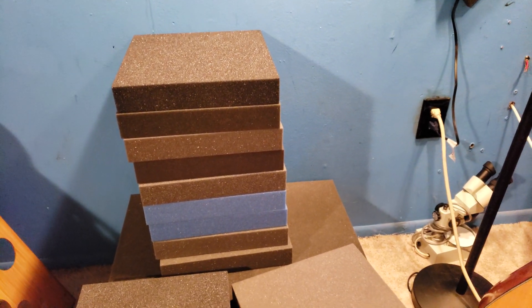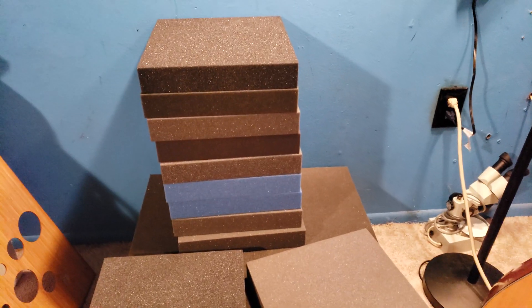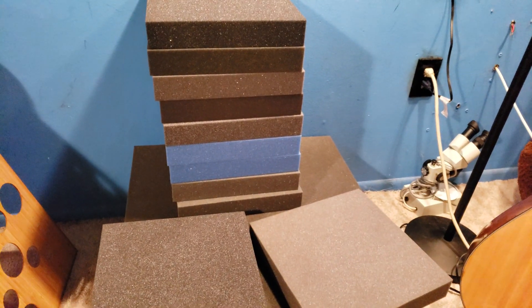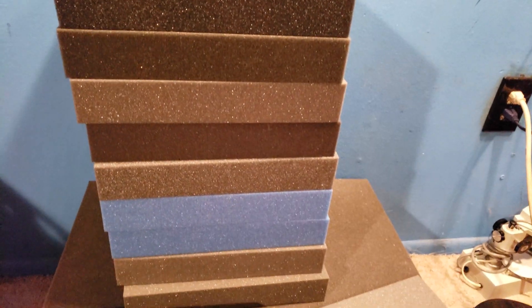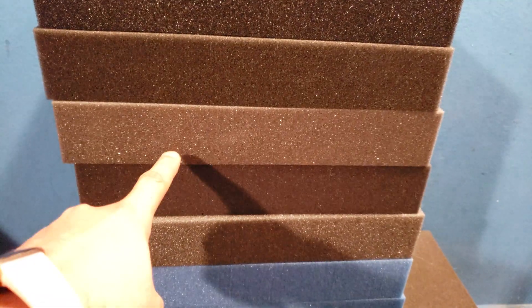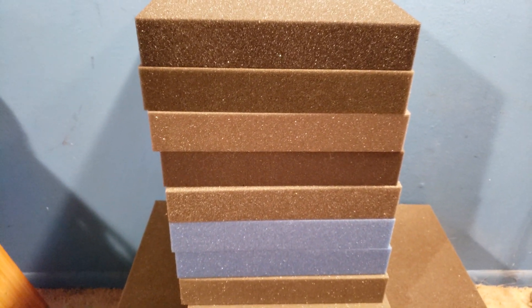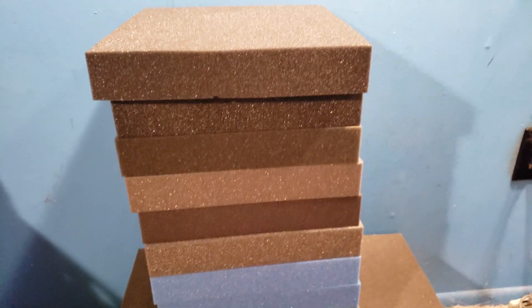Until you've been in a room that is truly treated correctly, do not give your opinion on what works and what doesn't. The differences between foams are visible — look at the sparkle. You can see a sparkle on the cheap foam that's very different from the real foam. Besides it being dense and making an audible difference when you talk through it, the sparkle test is the easiest and best way to figure out if acoustic foam is real acoustic foam and if it's actually going to help you in your studio.